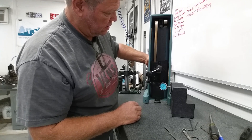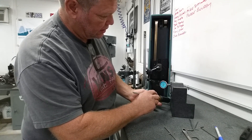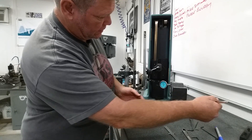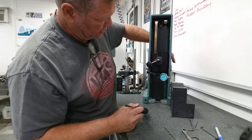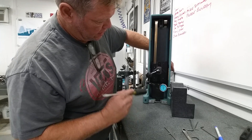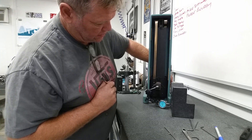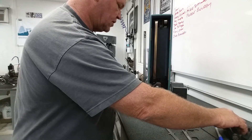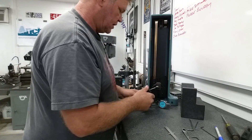So be careful with your Square Master — if you've got one of these things, don't let it get thrown around or bumped. It is a nightmare to get set back up properly. Let's run it up here and I'm going to tap this block out a little bit to zero, then come off and make a sweep straight down slowly and evenly. I'm just pushing the carriage with my thumb. I snapped up to zero and I'm staying on zero all the way down. Pretty happy there.